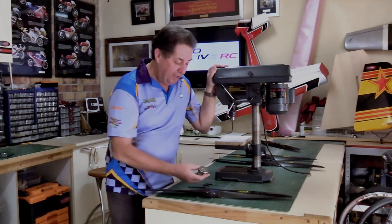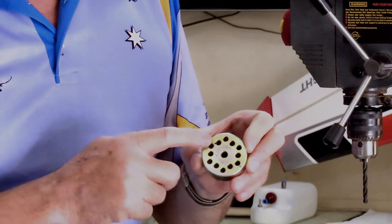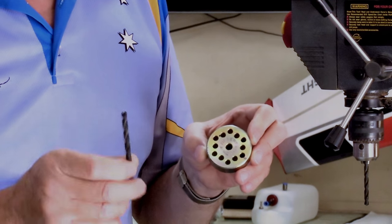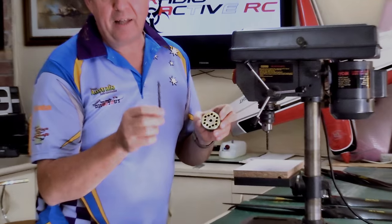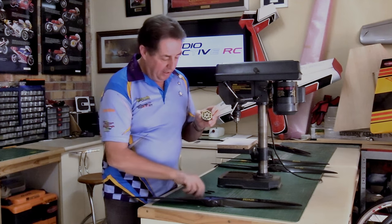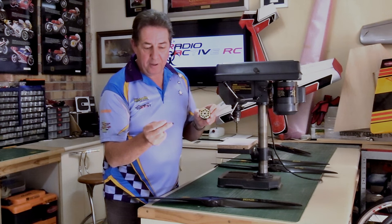The second part in the equation is a drill jig. Here we have a drill jig which has 12 holes in it. This one suits two size motors — 100 size motors which includes 120s and 85s, and the outer holes here are for 150 size motors. These are all 5mm drill bolt size and supplied with a 5.2mm drill bit. The 5.2mm drill bit gives you enough clearance to get the bolt through and accounts for any slight intolerances, so you don't really want any bigger than that. If you use a 5mm one it's going to be reasonably tight and it's difficult to get the last bolt in, so 5.2mm makes it a little easier. The other thing I use are two little drill pegs, made from old drill bits which I've broken off and shortened up — you'll see how these are used as I go through the process.